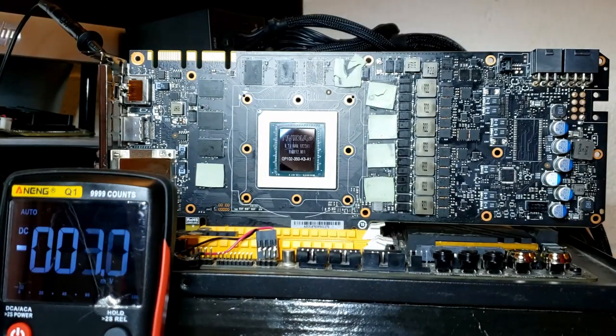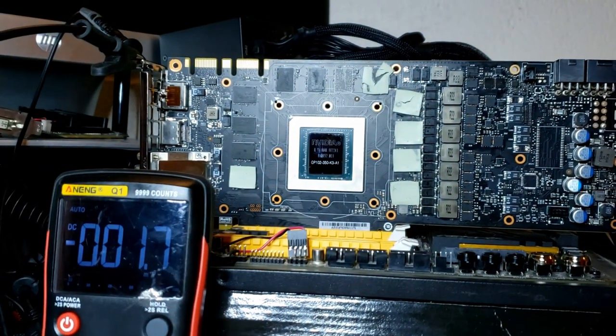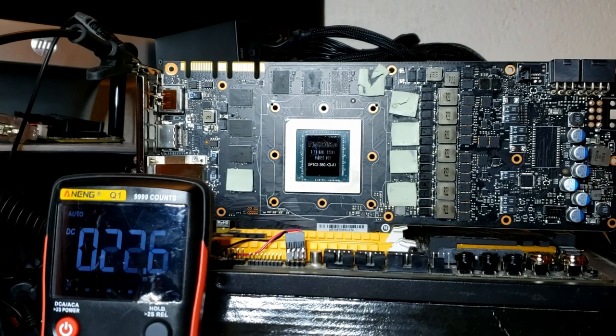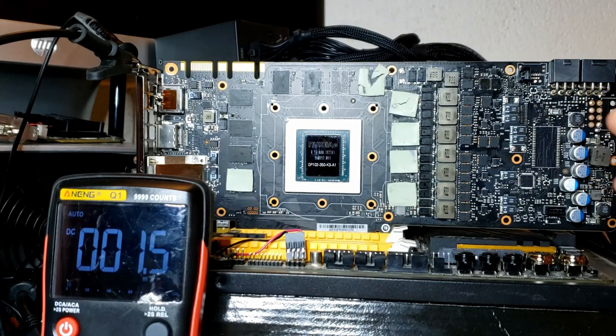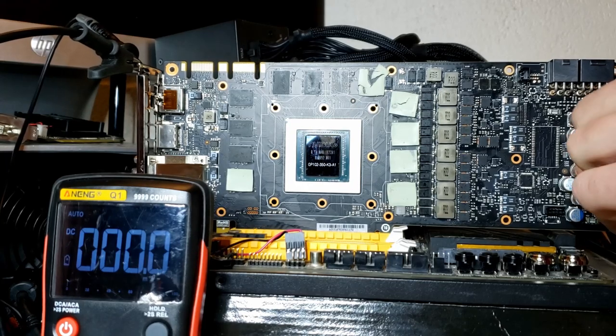What we're going to do is hook up my power supply and set it to 0.7 volts. I've picked this voltage because it's lower than any voltage rail on this card — the lowest rail is 1 volt on the PCI Express rail. So 0.7 volts will be safe for the GPU if we accidentally feed it on any rail. Without further ado, let's hook up the power supply and trace the path that current takes to ground.